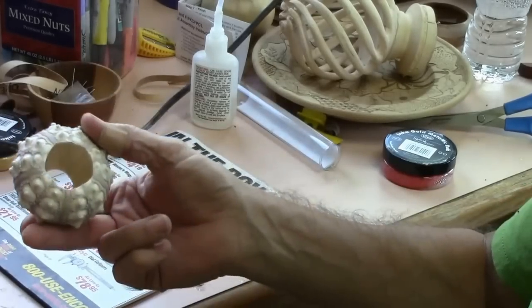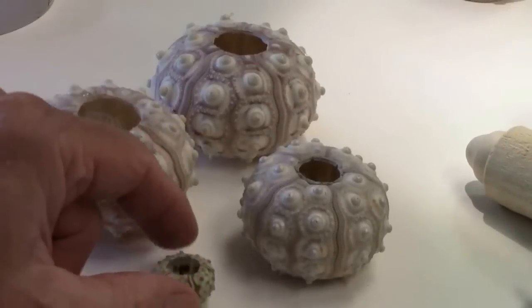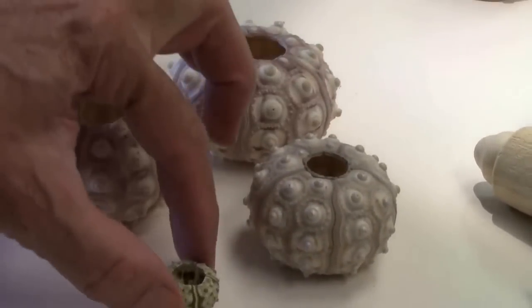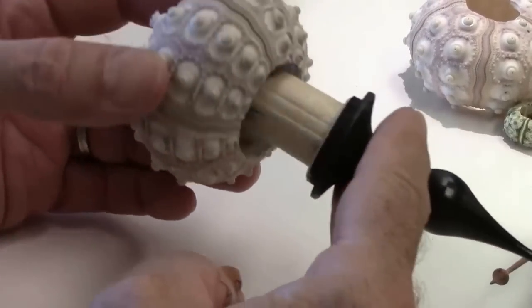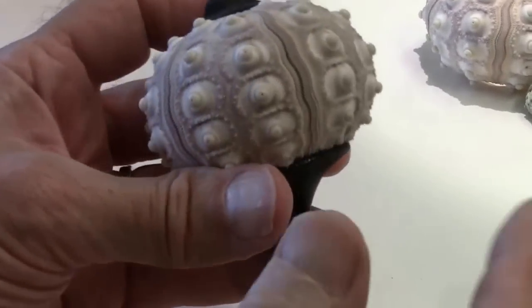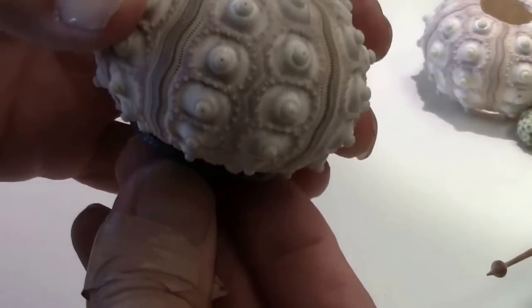Now I'm ready to turn the center for the sea urchin. No two sea urchins are exactly alike — some are larger than others and some are even misshapen; they're not symmetrical on the top, bottom, or sides. To accommodate this, I've come up with a different way of making the ornaments. The first way is to turn one piece that will fit into the sea urchin top and bottom, then simply put a hook eye on the top. That's turned out of one piece — in this case I use basswood. You could use white pine or any light wood that won't increase the weight of the ornament too much to be practical.